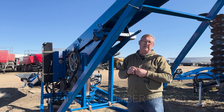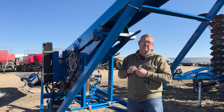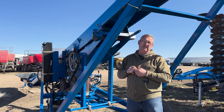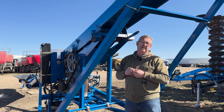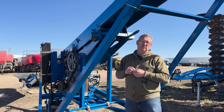The other thing to watch when you're looking at maintenance — and specific to this machine behind me — have a look at the bearings, even if they sound good. Because if somebody over-greased them, typically when you grease them you need to do a couple of pumps and then turn the machine over.